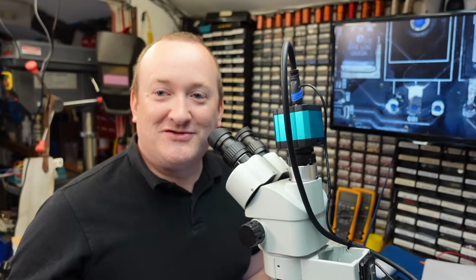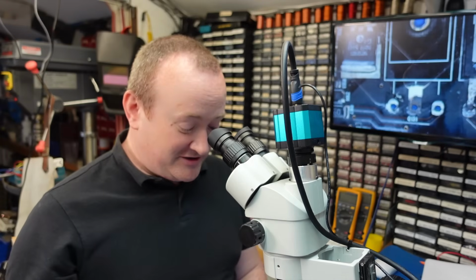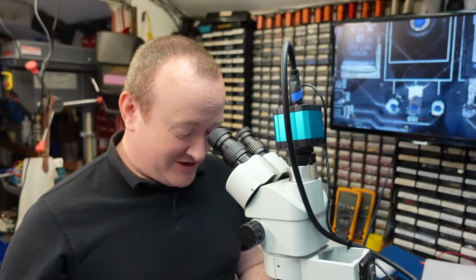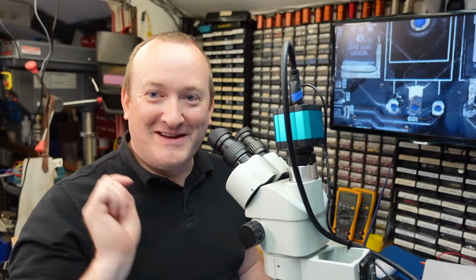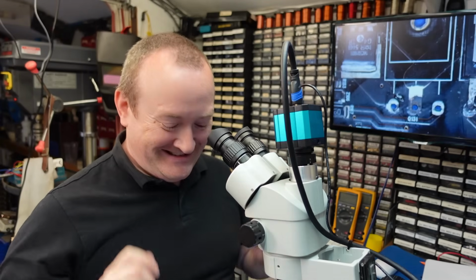Fortunately, the centre pin of this transistor only goes to the top layer of the circuit board, so I only need to repair the top because I don't actually know if the wire is intact or not, but it doesn't matter as long as we're aware of it. To fix the top track, I'm going to use this copper tape and cut a shape out that sort of fits and stick it down, then solder it on and hope it holds.